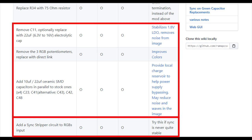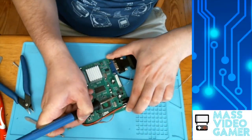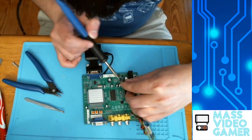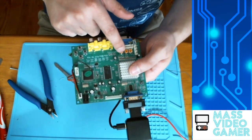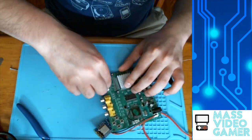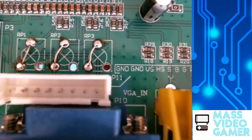My particular board performed fine without the sync stripper. If you want to see some incredible mods to this thing, check out the Shmups forum where people are much more experienced with this than I am. The first optional mod we're going to do is replace the C11 SMD capacitor with an electrolytic capacitor — just add a little extra solder, remove the SMD, and replace it with the electrolytic in the same configuration. Our next optional mod is removing the RGB potentiometers and direct linking them by first desoldering from the bottom of the board, then jumping them in the correct configuration using old resistor leads. When finished, you should have three bridges.